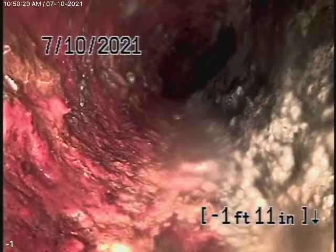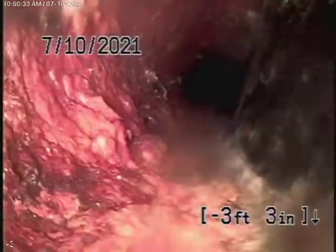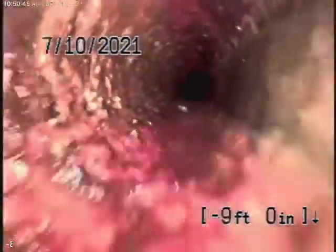Coming back nice and slow. You can see the cast iron pipe — it's getting very old underneath the house and has a heavy rust buildup. You can either replace the pipe to the outside and get rid of this cast iron, or install an end-of-the-line cleanout and try to descale as much as you can. People are living here and flushing toilets, so the line is functioning, but the cast iron is getting very old.